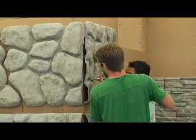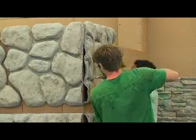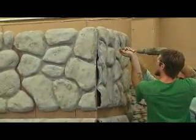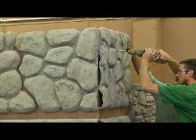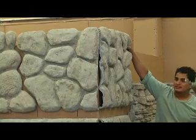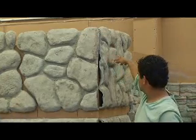The problem I've been having is that all the release agents I've found melt my latex skins. Latex is the wrong rubber to be using. But that's what Rico Rock sells, so you have to use theirs. We have skins that won't do that — they use different rubbers. We use a variety of rubbers depending on what we're trying to do: latex, silicone, and urethane.